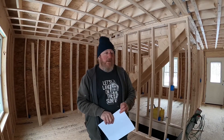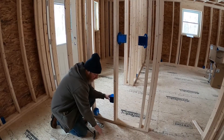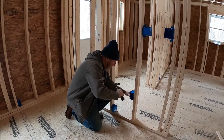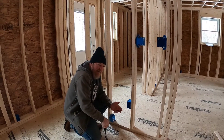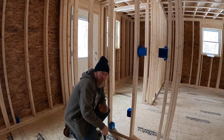We're going to start nailing some boxes on and then wrap this video up. Sue is going ahead of me marking at 18 inches off the floor — that height is really personal preference. I'm coming back and mounting the boxes. We'll go through the whole house like this, get all the boxes mounted, define all the lighting circuits, design the circuits, decide where the home runs come from, drill a bunch of holes, and then you'll get to watch Sue pull a whole lot of wire.